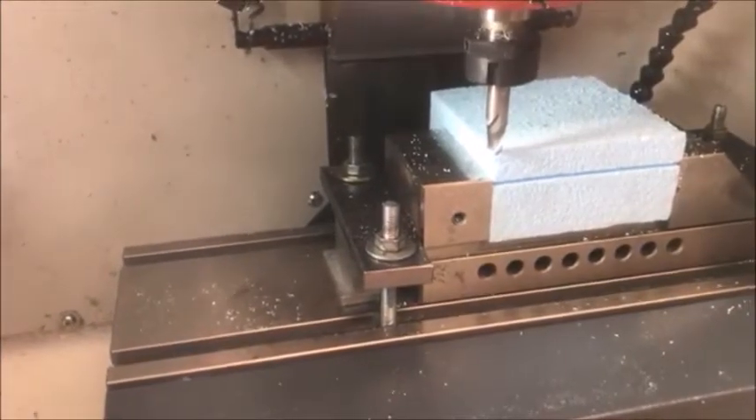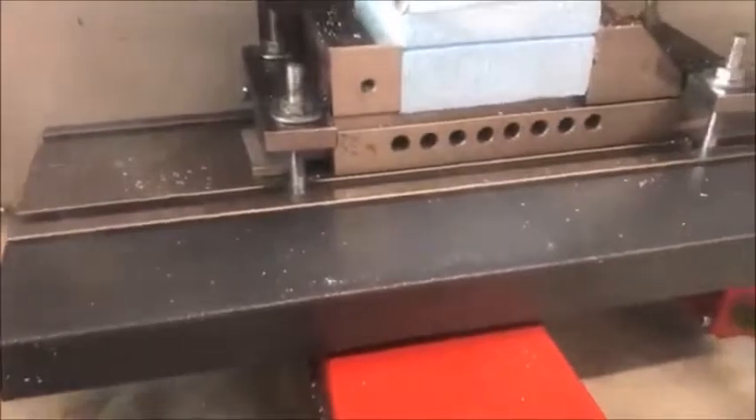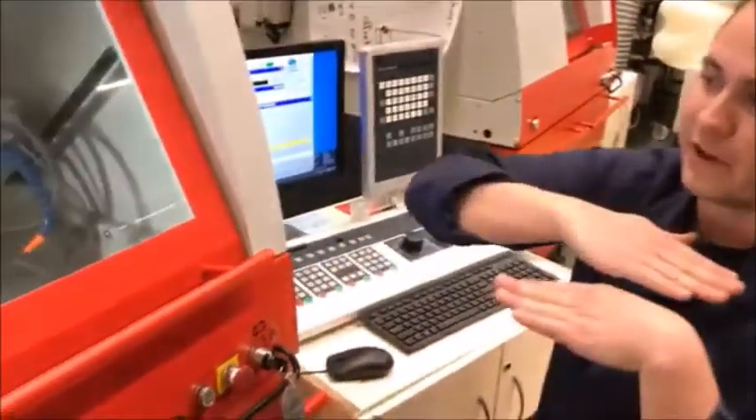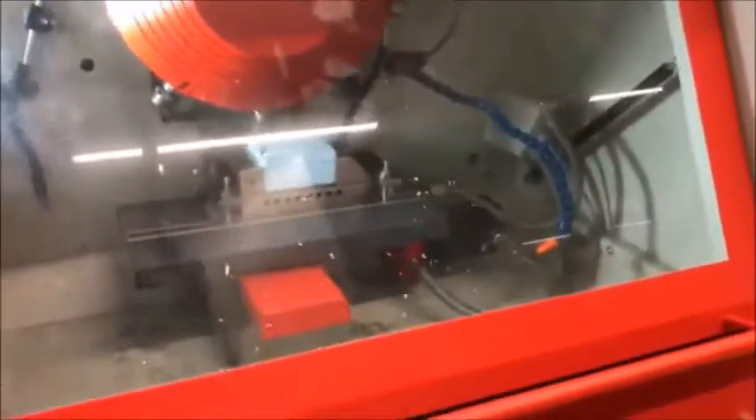You can see I'm a little tiny bit off on this piece, but that's because we've cut a lot of foam and there are a couple of different sizes in the box — some got a little bit squashed. But you can still tell the center of the cutting tool is at the total zero point, which is good. For the scope of this assignment it's fine, though if I was cutting my own work piece this probably wouldn't be acceptable. If I needed a perfectly level piece, I would face the top of the part first down a certain distance to get a really nice flat surface.